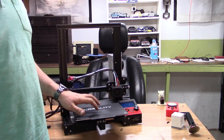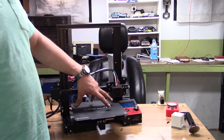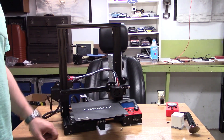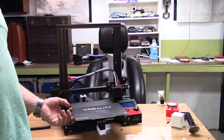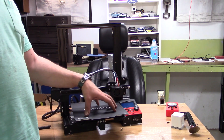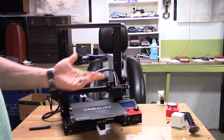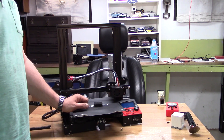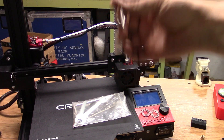The issue is the leveling — since it's a four-point system it ideally should be a three-point system. You can introduce twist and warp onto these beds if you go overboard with the knobs. Eventually what I'd like to do is machine some spacers and use some rubber to bring the bed down to just about the right height and lock it in. But until then, the dial indicator trick will have to do. So let's do this mod.